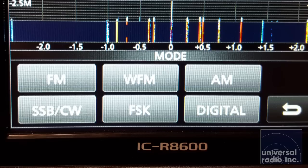There's a variety of modes that this receiver is capable of receiving. For analog modes, it can receive AM, FM, FM-wide, upper and lower sideband for single sideband, and also a dedicated mode for CW.